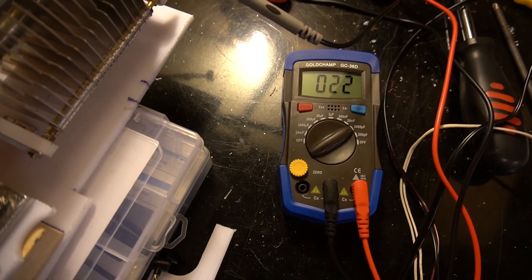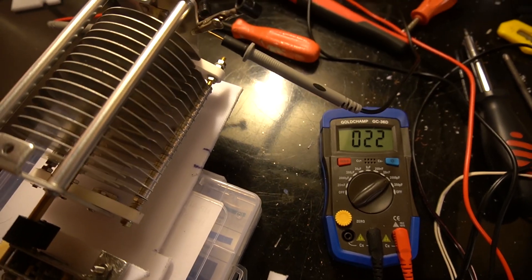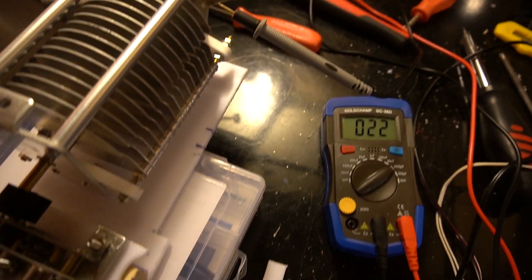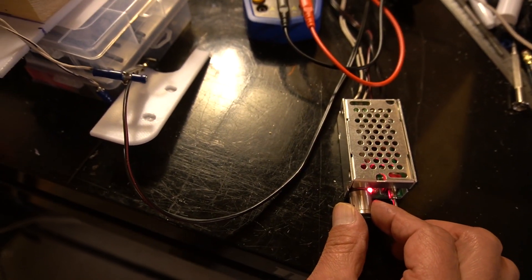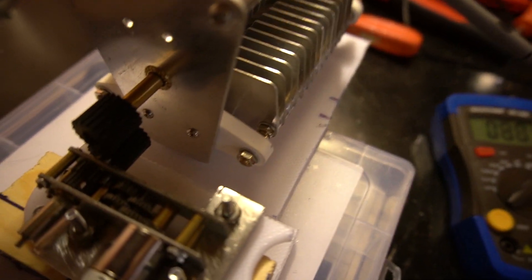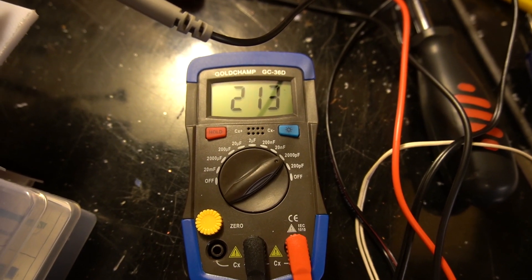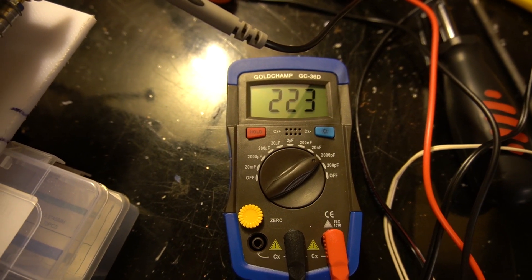As you can see, I hooked up the capacitance meter. When I bought this capacitor it says it starts at 15 pF to 240 pF, but for me it starts at around 21 to 22 pF. So, I increase the speed and as you can see it's rotating — it's really fast now, but of course you can slow it down quite a bit. And as you can see the capacitance increases. Actually it goes to 240 somewhere in there.